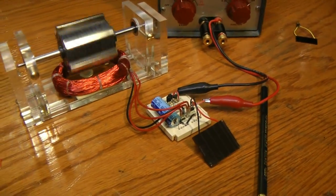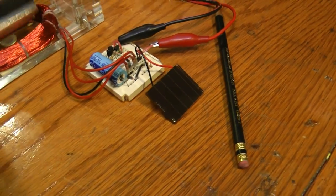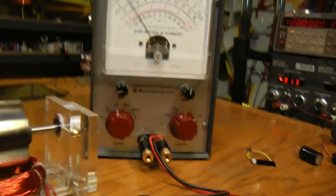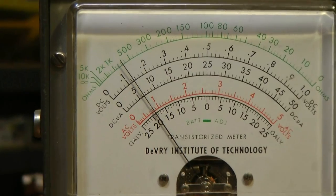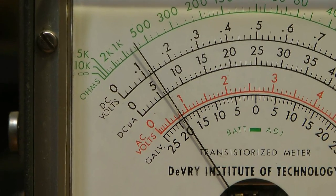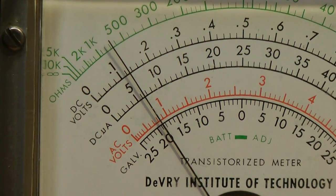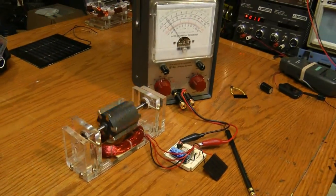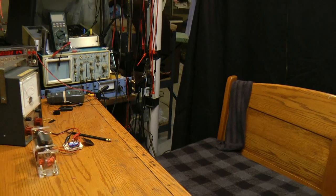This cell is actually from a solar garden light — probably 2.5 volts, pretty small as you can see by the pencil next to it. It's running pretty good. Looking at the meter, we're on the micro-amp range — the range right above the red — and for some odd reason these solar cells run really smooth compared to a battery. The meter is rock solid and it's running at about 53 micro-amps right now on the times-10 scale.